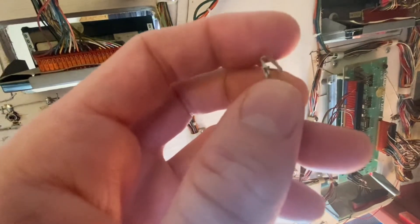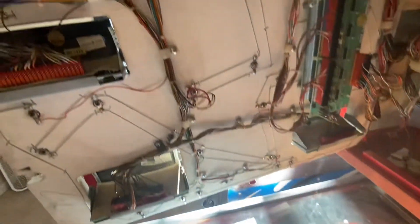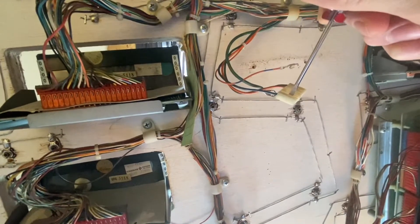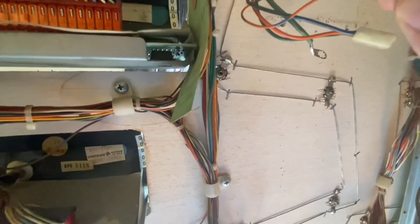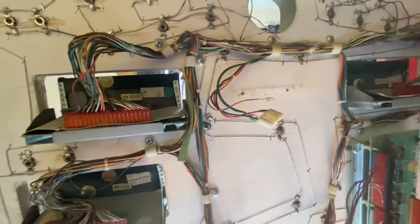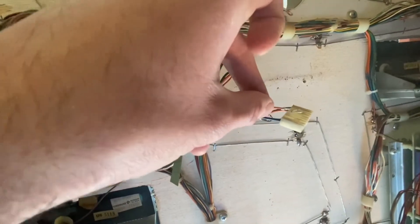I've already broken one off, and I'll just make sure that's flat and straight so it won't rub as it's going in. We'll break off the other one too, and then reseat it. The way you do that is push a flathead screwdriver in with just enough force to yank out the old pin. It helps to get in there a little bit at the very end and push it forward, because the last thing you want is the wire pulling out while the metal is still inside the connector — if that happens, it's going to be very, very hard to get out.